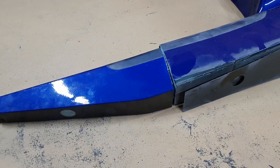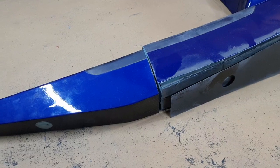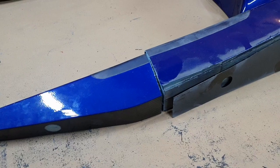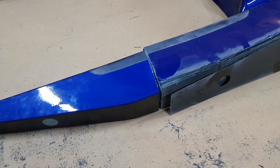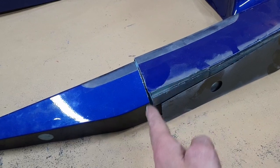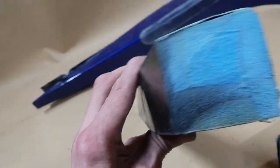It's the best thing for cutting carbon fiber, as horrific as it sounds, but it does work. Obviously mask up if you're cutting carbon fiber, and keep all electronic devices well away, because the dust is conductive, and if that gets into your electronic things that you cherish, it's going to fry them. But so the first cut was here, which then displayed the cross section.